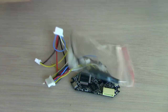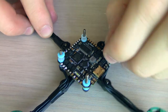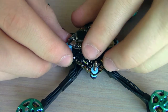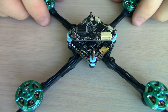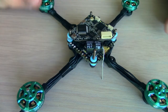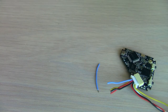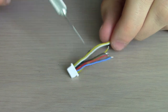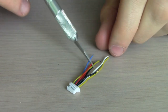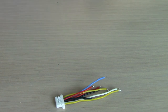Now I'm opening up the VTX, and it comes with a harness which we're going to be using to wire it all up. I'm first putting some of the included standoffs onto my board, and I'm going to orientate my board so that it's kind of pointing towards the front. My plan is to put my capacitor kind of in the back, so I prefer to have the VTX facing the other direction — but that's up to you. Now I'm cutting the plug of the harness, and I made a little mistake. I was getting a lot of video noise when I first wired it up, so I had to redo everything, but I'm going to show you exactly how to do it the right way. You might notice a little bit of discontinuity in the video from here on out.